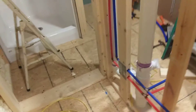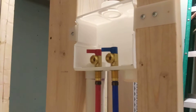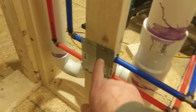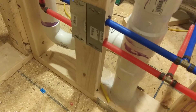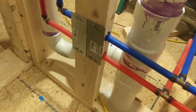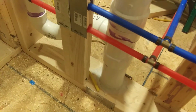So what's a protection plate? In this case I've got a cold and hot water line running up to my shutoff box for my washer. When I go ahead and put this drywall on, I'm not going to know exactly where these lines are. I could run a drywall screw right into them. If it was a water line, I'd know immediately. But more insidiously, if it's an electrical line, you might not notice, and you could get an arc fault which can result in a fire — especially if it's not an arc-fault protected circuit. Or in the case of a sewer line, you could slowly release methane and sewer gases into the house.